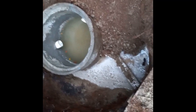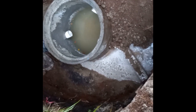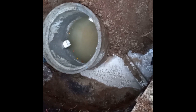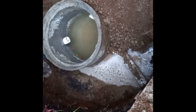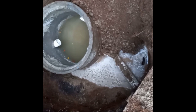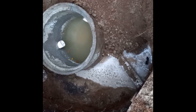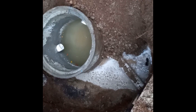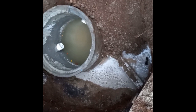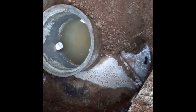It's the following morning and we need to fill it up. Look at the water in there — that's actually good, because it will help pack the soil and we won't need to tamp it. Just make sure you never throw backfill directly on top of the pipe. Throw it to the left and right and let it naturally slide down — never dump backfill over the pipe itself.